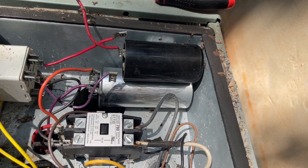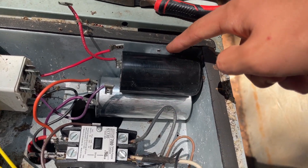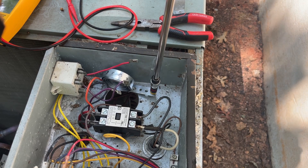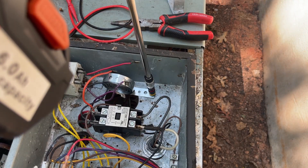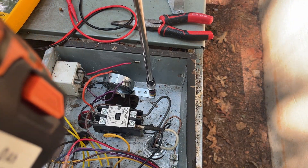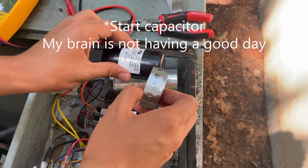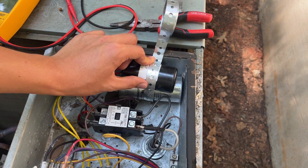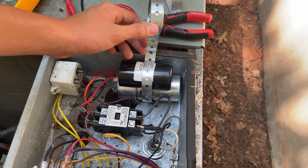I'm thinking I will mount the capacitors like this, and I'll have a strap come around the bottom and then up to this. I have a self-tapping screw in the end of this and I'll put it into the strap. I also confirm that there's no pipes or wires under this. Now I'll put my capacitor in here, and now the running capacitor. If I bend this like this, I think I can get a screw into the other hole. I'll go ahead and cut this strap right now.